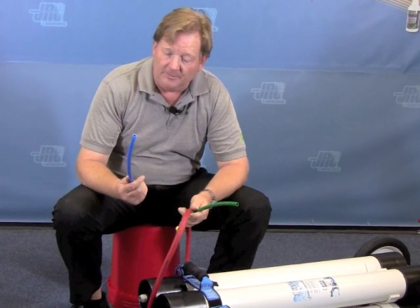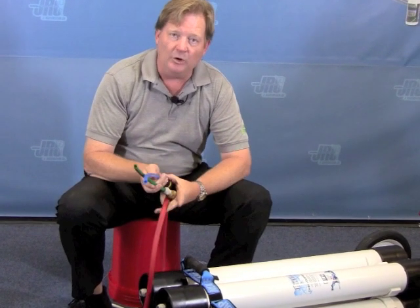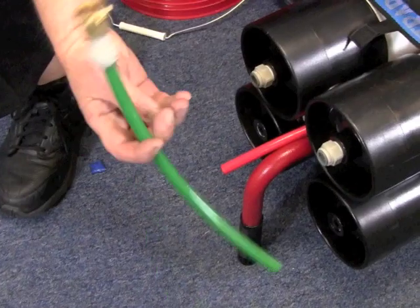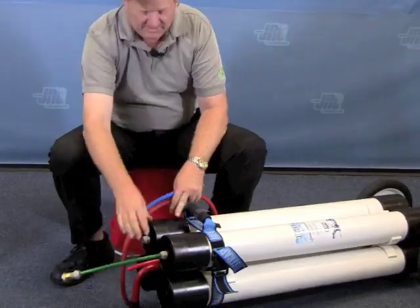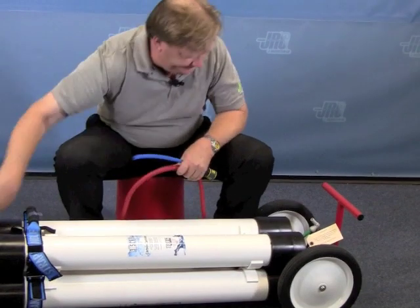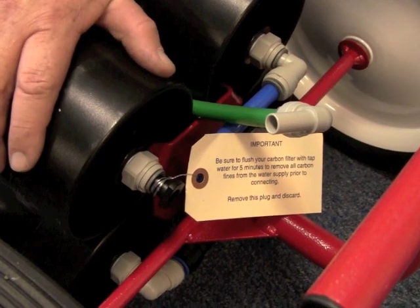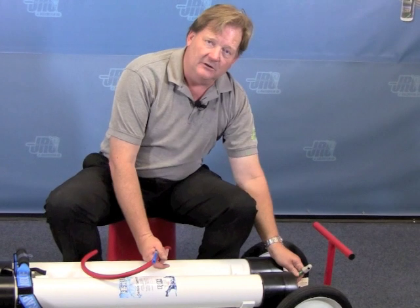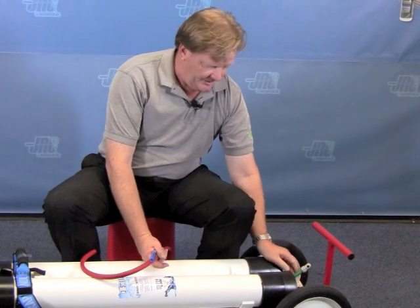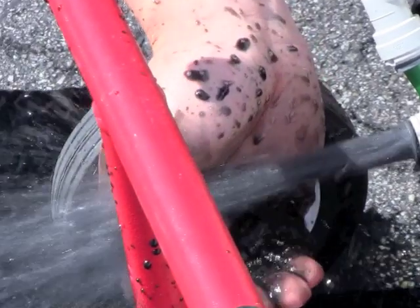You're going to receive these three parts. Tap water goes in and that goes into the carbon cartridge. You flush out this carbon cartridge with water before inserting, on the other end, the water that goes onto the RO. There's a little bit of black carbon fines and dust in here that needs to be cleaned out so we don't overtax the RO.